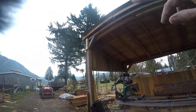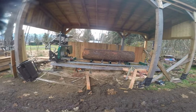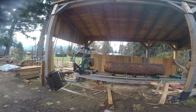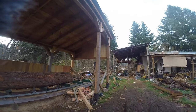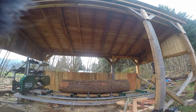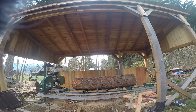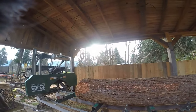I added six-by-six bracing up there, which gives me a nice just-under thirteen-foot opening in the front. A better approach might have been to add a short section with another post here to split the opening, so you had like sixteen feet in the middle. But for the rare occasions I do sixteen-foot logs, I can load them at an angle — or cut it, spin the log around, and slide it back. For me this works; it'll be a straight load on ninety percent of what I load up.